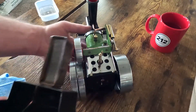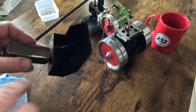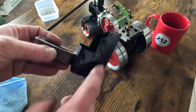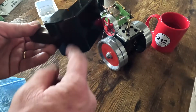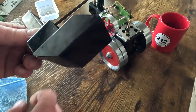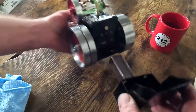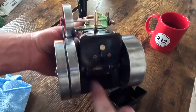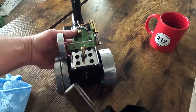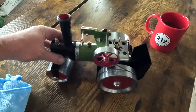This is our burner assembly. This is another indicator of the first generation, because the later ones had a handle — the burner assembly wasn't mounted to the rear scuttle; it had a hole that came through and when you slid the burner in, the handle acted as a hitch. That's another telltale sign this is one of the first models. It installs by small hooks here and here that correspond with these square holes here and here — it just sits in and drops down.